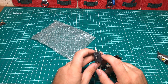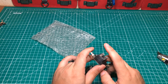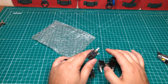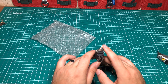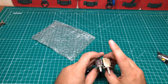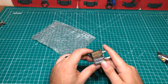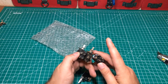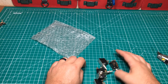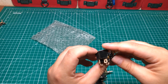One of the things about these switches is they bring a full 110 volts, or 250 depending on where you're at, out to the outside of the case. So you want to be careful when you're working on these that you don't grab some hot power there — I've definitely done that before. These things are not expensive, but when they break you want to have a replacement. I am a little frustrated — these things look completely used. You've got different styles, different colors, dirty, and this one looks like it's got schmoo on it where it's been melted. They're going to be hearing from me on this one.